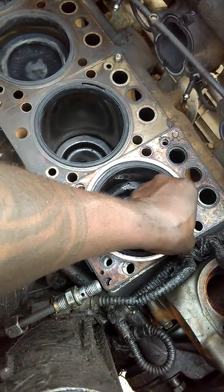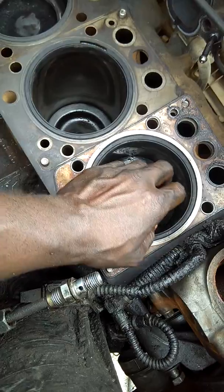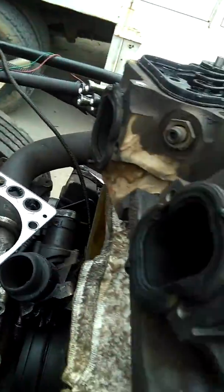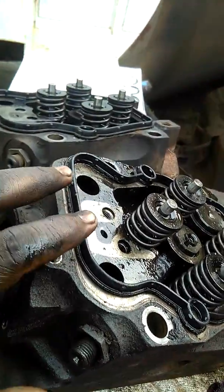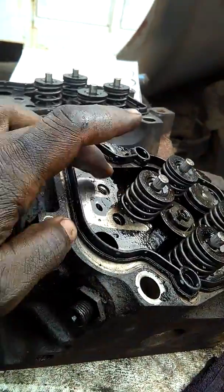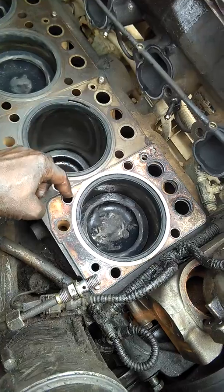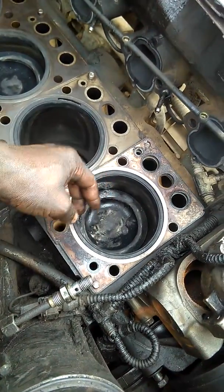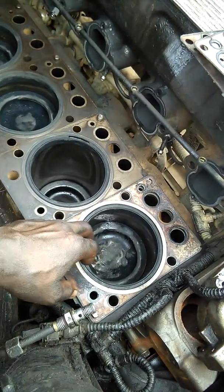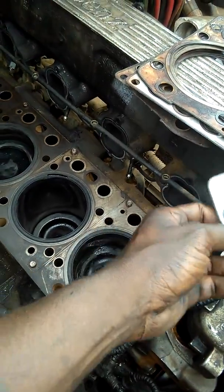The gasket sits over the engine chamber and the pressure generated inside has to be contained. All these are valves that come up to your head - this tractor has six heads. All the pressure in your head, each little valve in there, has to be airtight. Because this gasket got old and worn away, that pressure was escaping the chamber and getting into your water supply. The water cools the engine, so that's what caused the overheat.